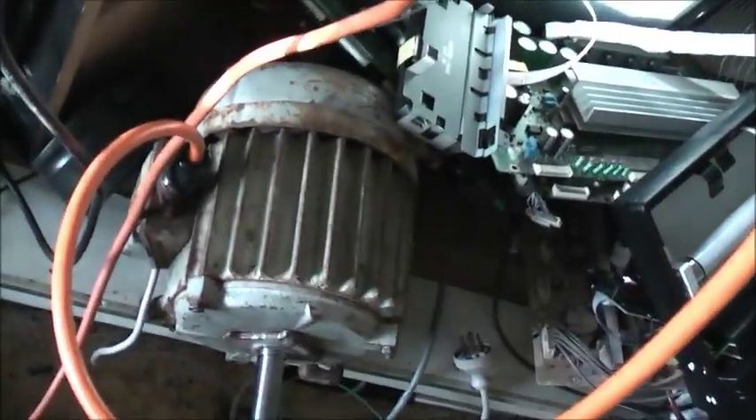If I start putting load on it, it'll probably start pulling some power. It doesn't go up by much at all. Yeah, I need to turn the voltage up — I need to configure it to get more voltage into that motor so that drive gives it full power to run that motor at maximum torque, like I did with this one. I've also fixed my wiring up there — it's much better. I'd rather set this up with a potentiometer next.